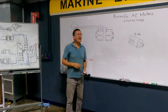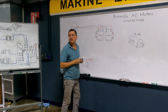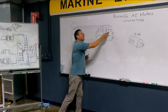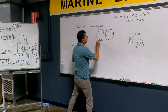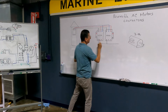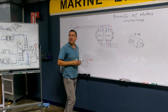In the second breaker I am going to flip phase two with phase three. In the second breaker, phase two goes to the third position, and phase three goes to the second position. In this breaker I flip them. In the bottom, the output will be the traditional way — black with black going into the motor, red with red going into the motor, and blue with blue going into the motor.